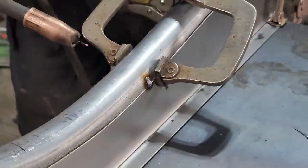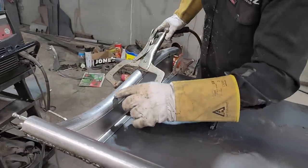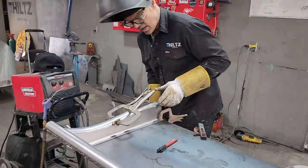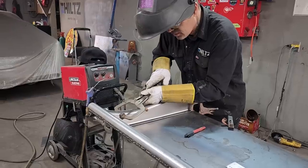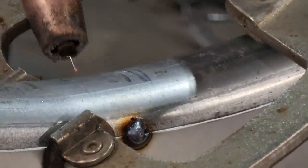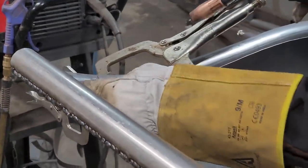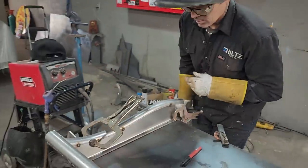When I put the weld on this, I think I've explained it before, I will put more weld up top on the exhaust than down on the metal. And the reason being is I'll be able to feather it off like I did that one. I did not exactly get that butt welded on there, and it does not have to be butt welded on there whatsoever. Not even close. So it depends on how you weld it up, how you're going to grind it off. So I will put more weld up top so I can really grind it off nice. And it'll make all the difference.